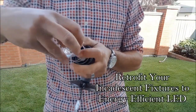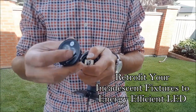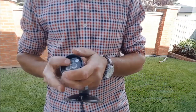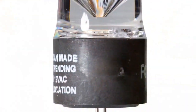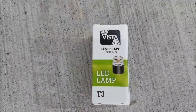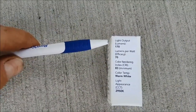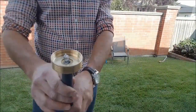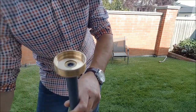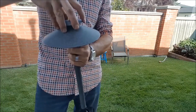If you have an existing landscape lighting system that is incandescent, it's very easy to retrofit with LED bulbs — again, just to save power and not have to be changing bulbs all the time. What we often recommend is go find really good quality outdoor-rated LED bulbs and then go find really good incandescent fixtures, and just marry the two together and retrofit your incandescent fixtures with really good quality LED bulbs. It will help bring the cost down rather than going and buying a fully integrated LED fixture, which looks good and lasts a long time, but does cost a lot more.